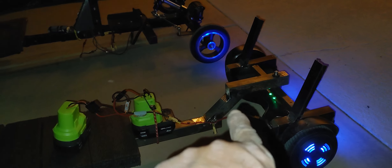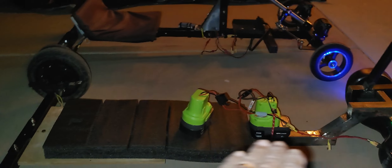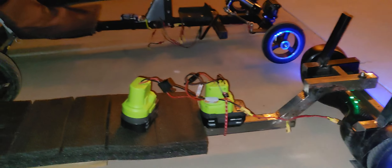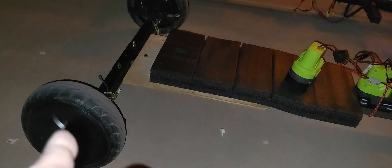This is not complete by any means, but I just wanted to see how this would ride with the lower frame. I welded that section right there to bring the main tube lower — that's sitting about two, maybe two and a half inches off the ground, a little bit higher at the back because those wheels are much bigger. Those wheels are from a hoverboard that I'm just using as free wheels, not connected.